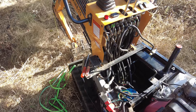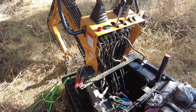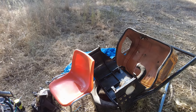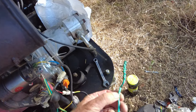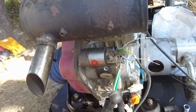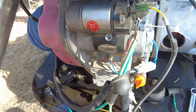I contacted many people. Nobody is interested to come out here. Then in my desperation, I took off everything — also the weight, the balancing weight. And then I found a melted cable that comes from the battery to the coil, and the other one goes to the relay switch. I connected it with a simple electrical connector and it's working.